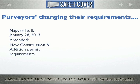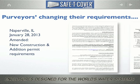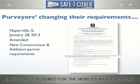Finally, just after the first of the year, Naperville saw Elgin and raised them one by calling for RPZs on all commercial and multifamily lines, irrigation, fire, and domestic.